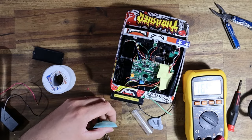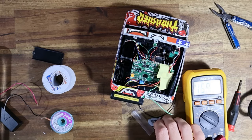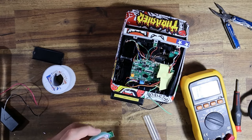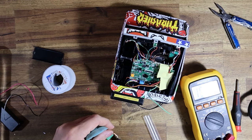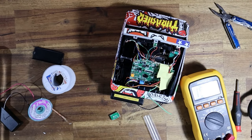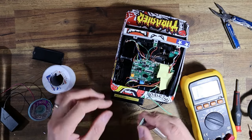So I'm just cleaning up all the solder that I got into the little pads. Blue tack out. Great. All right. Just a little bit more solder in the positive to clear, and then we can start wiring this thing up. Great. Okay. Just going to grab a cloth and my alcohol and clean all the flux off left behind by the solder. Great.